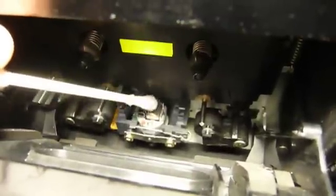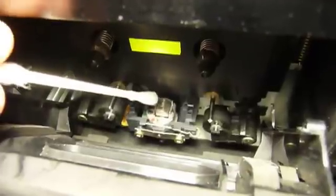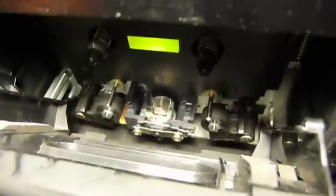Here I am getting ready to go after the heads in this machine. This particular machine is a two-head machine. There's one head for playback and recording — that's the silver one — and then the smaller head over here is actually an erasing head. On cheaper decks and many portables, the eraser head has oftentimes been replaced by a simple permanent magnet that just swivels out whenever the recording mode is selected. But all better quality decks typically have an actual erase head driven with an AC biasing signal. And in this machine, and many machines out there, one head does everything.